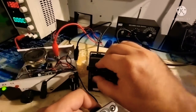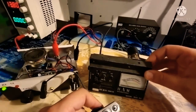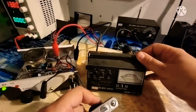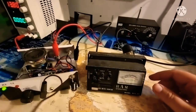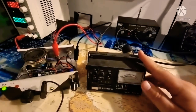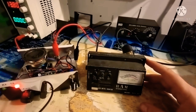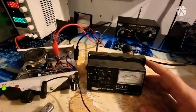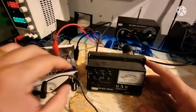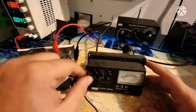We're gonna put in the 1 watt selection. We have a small dummy load here in the back. Hello, dummy. And we'll see how much output power it gets out from a 9-volt battery. So 1, 2, 3 test, 1, 2, 3 test, and that will be about 600 milliwatts. 600 milliwatts with a 9-volt battery in SSB in 80 meters.